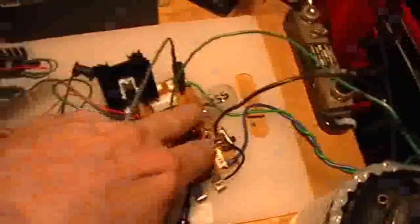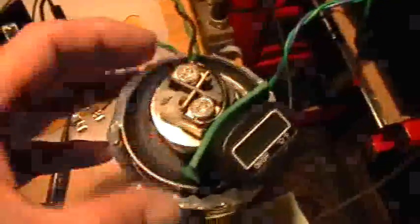Some of you may be worried about the phase relationship that I've shown from my instantiation of the Rosemary-Ainsley circuit using IRF-830A MOSFETs in all five positions, using a lot of extra wire. These two items are my internal board load, and they're not in the circuit — I've switched them out with this switch. The only load we've got is this heating element, a water heater element in 300 milliliters of mineral oil with a thermometer vent and all.